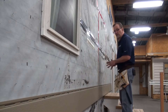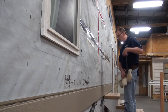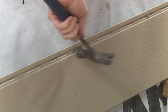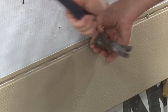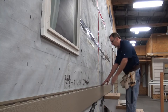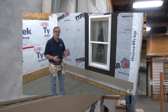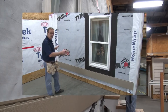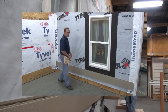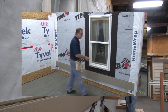You don't have to find the exact center of the wall — just somewhere in the general vicinity will do. To pin this course, we'll place a nail in the center of the left end of a slot and a nail in the right end of that same slot. That way, from this point, half will go this way and half will go that way. If I was working on a shorter wall that's less than 12 foot wide or one panel in length, my gaps would only need to be a half inch on the inside corner and a half inch on the outside corner, and I wouldn't need to center pin the courses.